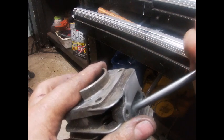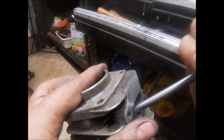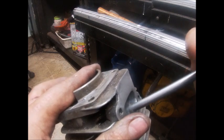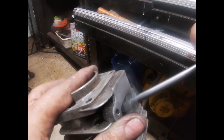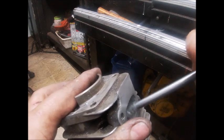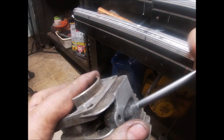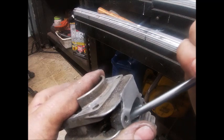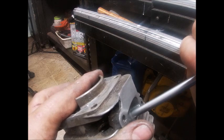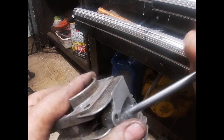Cleaning up and polishing your exhaust port will probably move it like half a degree — it may make a total degree of open-to-closed duration, and that does matter. Some people just worry about where it cracks and opens, but that's all fine for determining how much compression the saw is going to make and where your peak RPM is going to fall. Port duration, total port opening, and total port volume — you have to take it all into consideration.